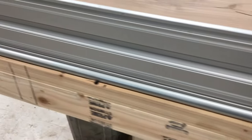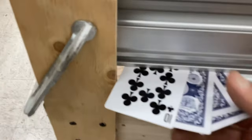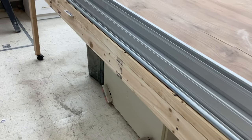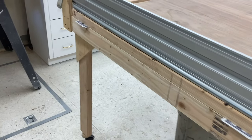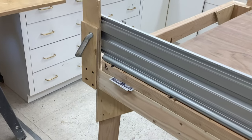Gap maximums between the fence and the rail were visually located and measured using stacks of playing cards. In this case, there were three gaps of three, one, and four cards. The fence was removed and the screws holding the rail to the table were loosened so that the stacks of playing cards could be inserted below the gaps between the rail and the table. After re-tightening the screws, the fence was used again to measure the rail flatness. After adjustments, the flatness was within one card thickness — about 12 thousandths of an inch.